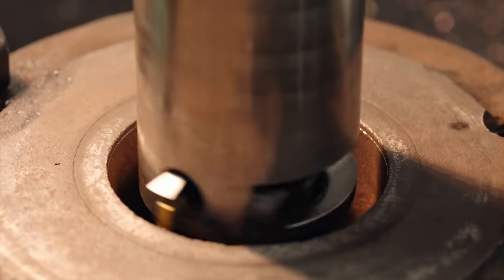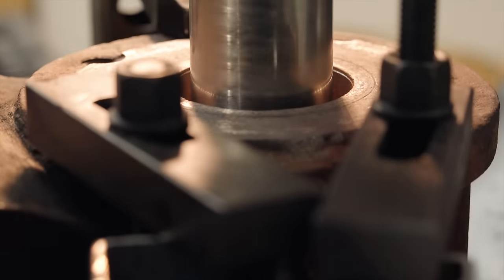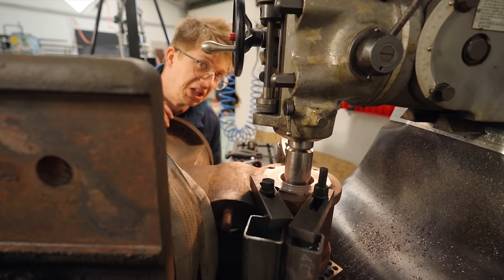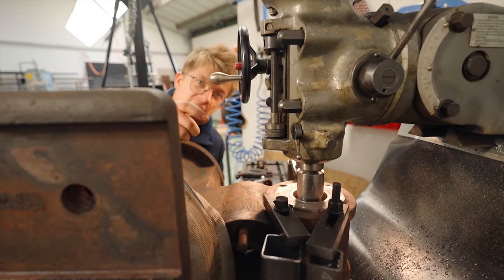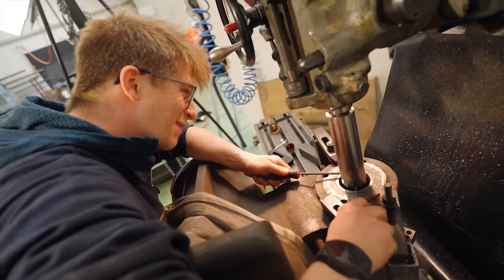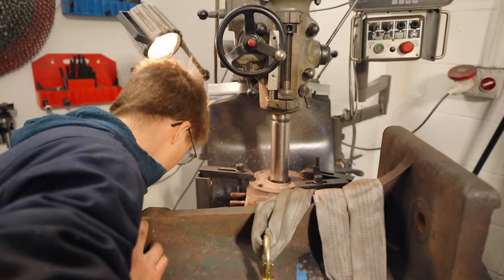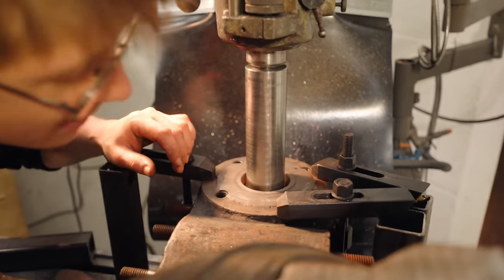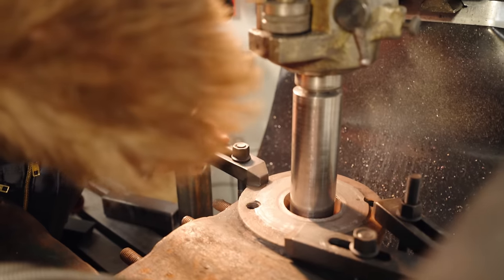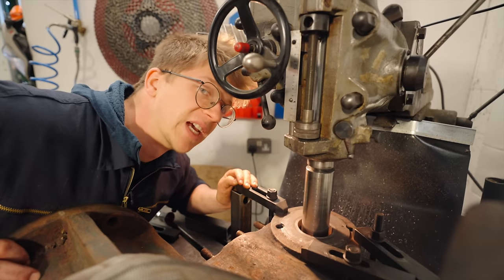The whole idea here is close to cutting but not cutting — so we can see if it gets worse down below. We've got the whole way down without contact. It's a third iteration of moving the tool out and we are still not contacting at the bottom. I'm gingerly moving this tool out — we've got a cut! It's now wide enough that we have a cut here at the top. Let's skim this whole thing down. The cut sounds like it's getting slightly deeper and is slightly interrupted, which we should expect because it's a pretty nasty bore. It's still a very gentle cut, sounds pretty consistent. For something that's so boring I really do feel like I'm on the edge of my seat.